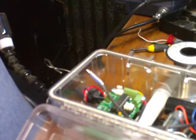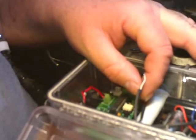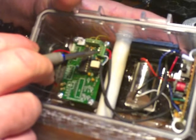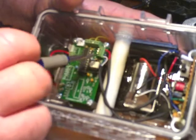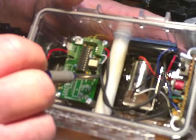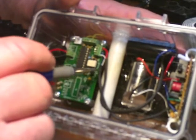Now I want to wire up my trigger for my slave. My blue will be F negative and white will be F positive, so go ahead and connect those up. My blue is my F negative and my white — which is normally red — is my F positive. It doesn't matter the color of wire as long as you have them in the right spots. That's my trigger — the trigger causes my slave to fire.